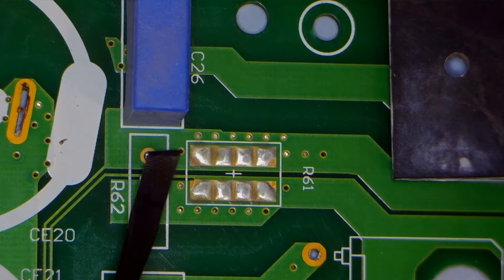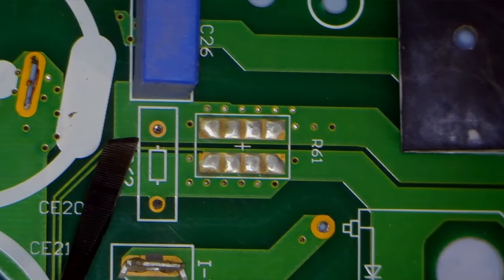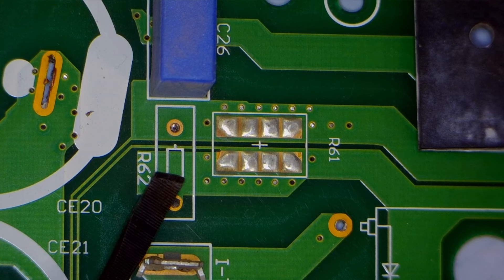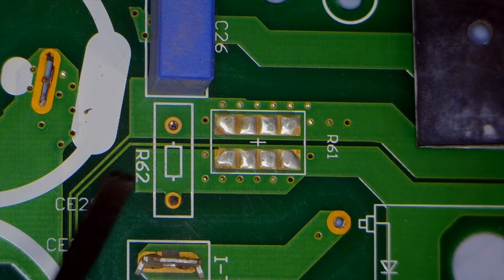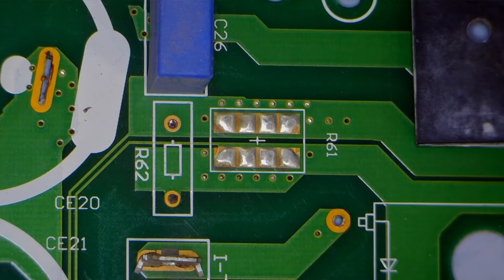You can see they are connected. Here, a shunt resistor is installed. You can see two points — one comes directly from the bridge rectifier, and the other wire goes past the shunt resistor. After the voltage passes through the shunt resistor, two wires measure whether the DC voltages are proper or not. These lines are specifically designed to check the negative voltages.